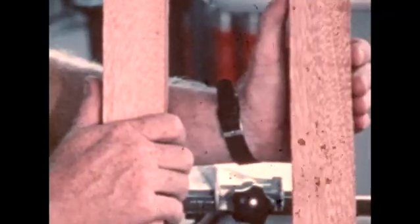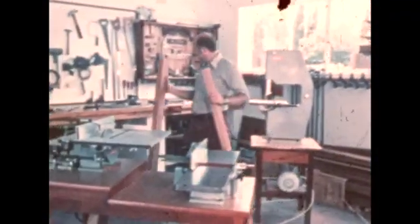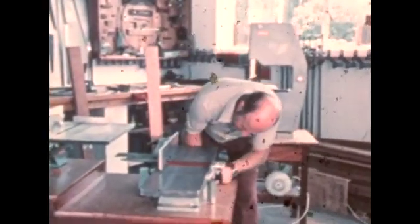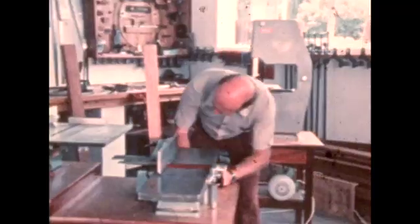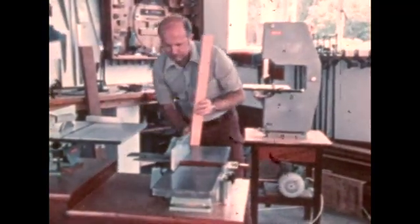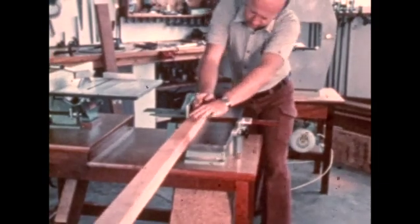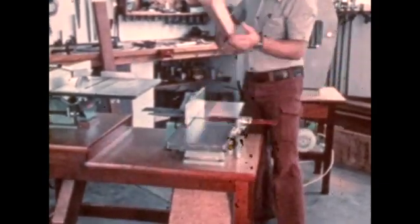Now that the wood's been roughly sized, let's move to the planer and thicknesser. The first step is to adjust the table. Normally you should take off 2,5 millimeters at a time in softwoods and 1,5 millimeters at a time in hardwoods. And always remember safety precautions. Keep both hands on top of the wood and don't palm or thumb.